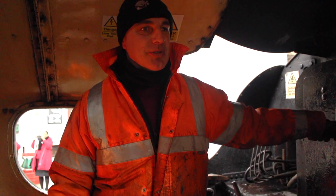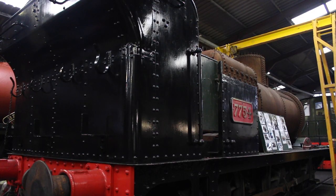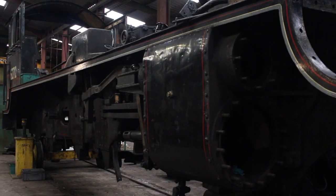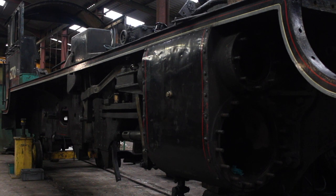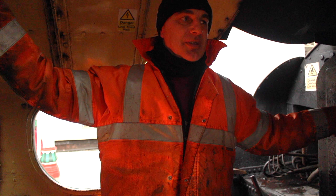So you look at what we do at Carnforth, you look at Riley's and Sons in Bury, you look at the Severn Valley, Tyseley Loco Works, they're all developing their own skills and reinventing the wheel almost. Well, we're building new engines now, like Tornado, the new engine they built. The Patriot, which has been built at Llangollen with their facilities. Everything can be made for steam locos now. Coppersmiths to make the copper fireboxes, we can press all the plate work for the boilers, we can cast wheels, we can make tyres, we can make cylinders, we can make axles. It's all there. Make a pattern, get a casting, get it machined. Biggest job's finding the drawings and getting the design right.